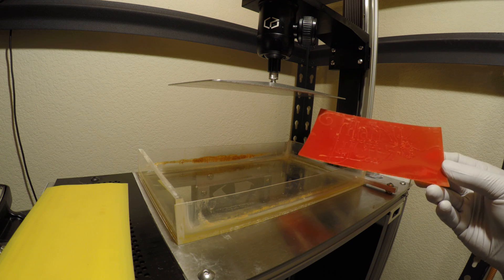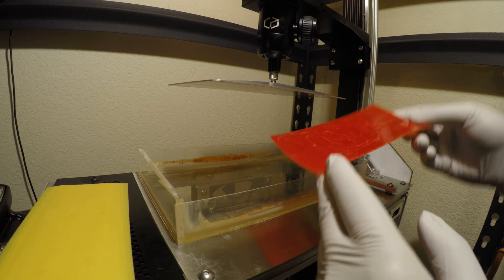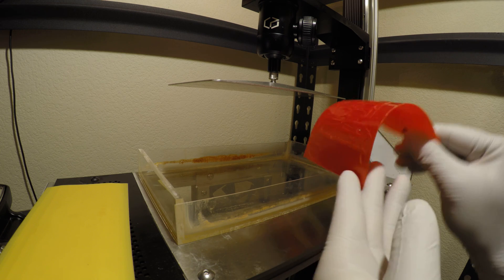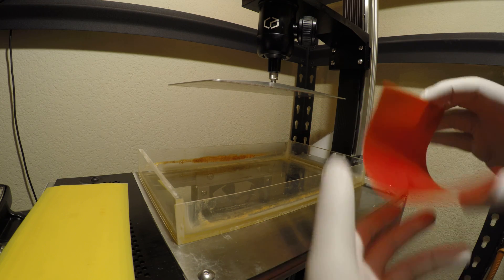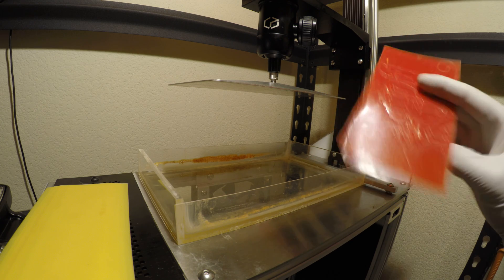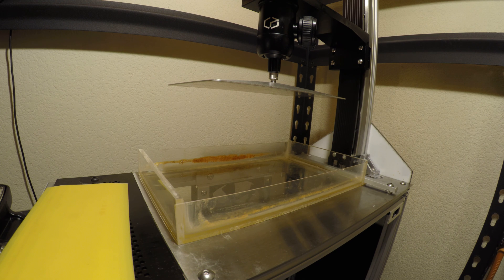It is a bit tricky because there's this huge flat surface. Since you are letter pressing, the top is the inked surface that's going to go onto the paper — you don't really want to print it at an angle, because this thing is just not going to be stiff enough. It's not going to give you the surface and accuracy you need if printed at an angle, so I'm going to print it flat.